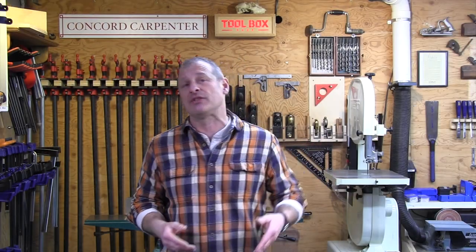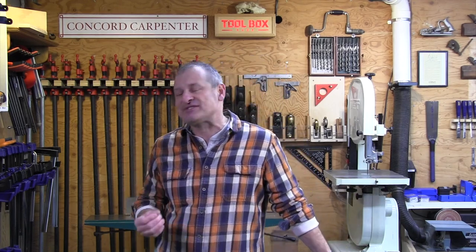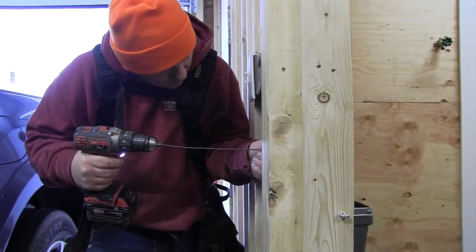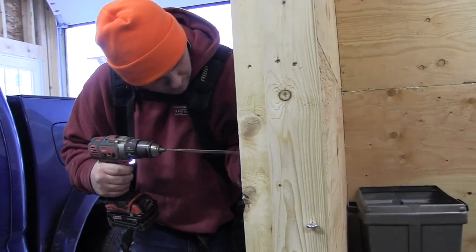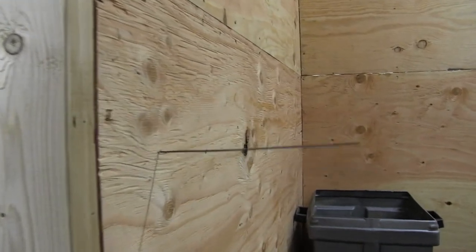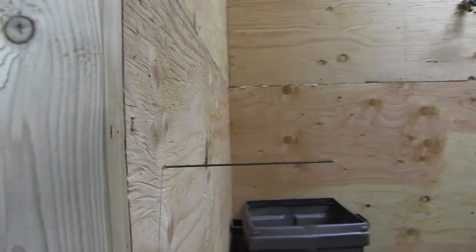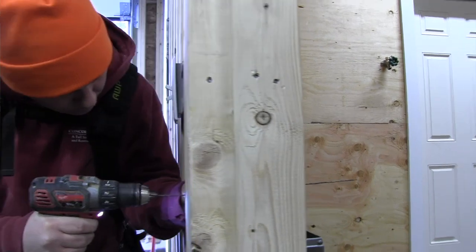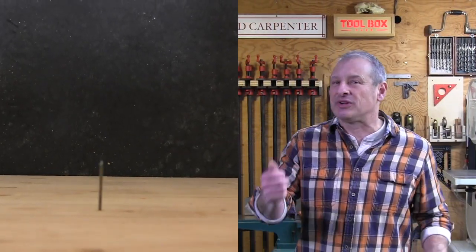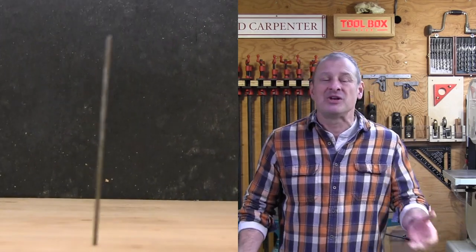The rods are about 16 inches long and they're perfect for passing through floor cavities. The main reason I like it, it also saves a considerable amount of time later on. What I mean by that is from patching exploratory holes that we used to have to cut in walls and ceilings to see what's there. That's because the probe allows you to just go right through the assembly without causing a lot of damage. The best part is that the hole created by this very small probe can be easily filled with a little bit of spackle, or not filled at all.